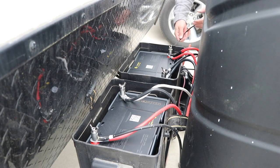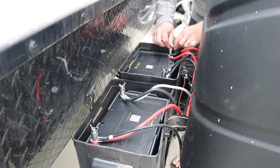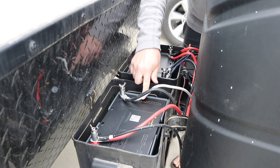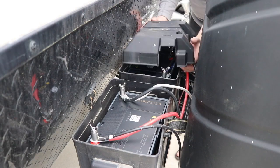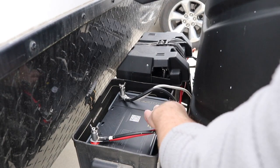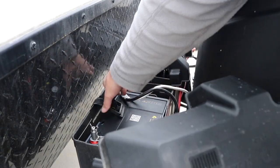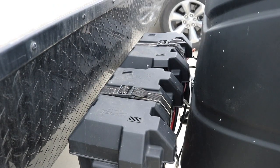We've just got these two little sensor wires now. I need to put some nice lugs on them, but for now we'll put them on the top terminals. Both batteries are connected and we've got full power. Now let's button up these boxes — and we're done. We'll replace the box on the second battery; it has fewer connections so it should be just a hair easier. Make sure the terminals are tight. The batteries are all strapped up and we are good to go.